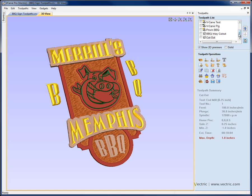When it comes to saving toolpaths, because I use the same tool for many operations I can output several in a single file. The first pocket, inner pocket, and BBQ inlay can all be cut in a single toolpath since they all use the quarter inch end mill. The texture uses the quarter inch ball nose, so that needs to be separate. The v-carve text, v-carve pig, and prism letters all use the 120 degree v-bit, so they can be output as a single toolpath. Finally, the inlay cutout and the sign cutout can be combined as one toolpath — as long as the BBQ inlay cutout comes first, so it doesn't release the sign blank before cutting the letters out.